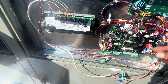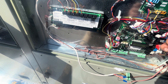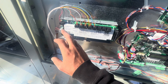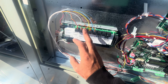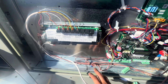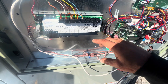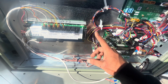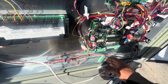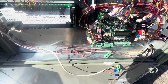It can only handle so much 24-volt control. So the solution is to install isolation relays. The relays on the Emerson board will power the coil voltage on the isolation relays, and then I'll get my switching voltage off of the Symbio 700 control off of R, which will completely separate the voltage, completely separate the transformers, and allow both boards to work independently with their own separate 24-volt control voltage. That's the solution — we're going to install those isolation relays and get to it.